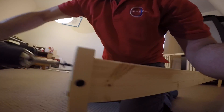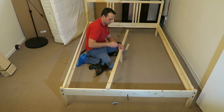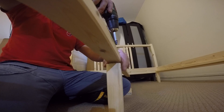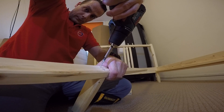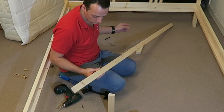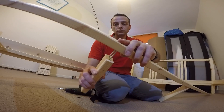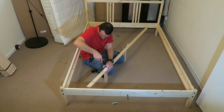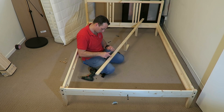The bed frame is almost secured — it's a solid 3D frame now. This is the middle part that's gonna support the bed in the middle. We're gonna have three legs, so just join them straight with two long screws through the top panel of the mid beam to the leg. Find the holes, close that in, and secure it with two long screws for each leg.